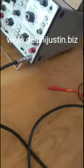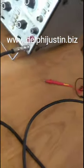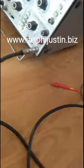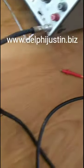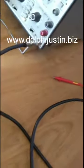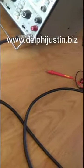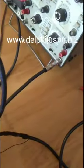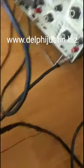Because they go in parallel. And when you have parallel resistances, they go down, and that can interfere with the circuit. With a 1 meg on there, usually that doesn't really bother it, because your circuit will usually be between hundreds of kilohms to 1K or so. And that doesn't hardly bother the circuit at all, because it'll go down a little, but not that much.